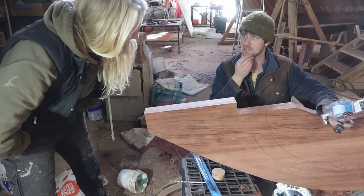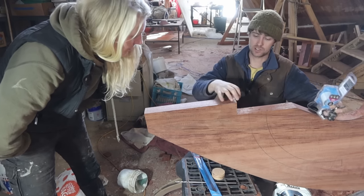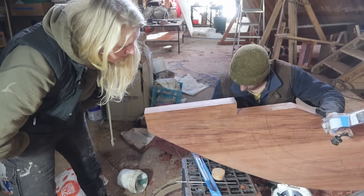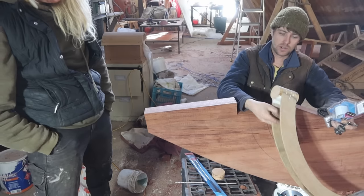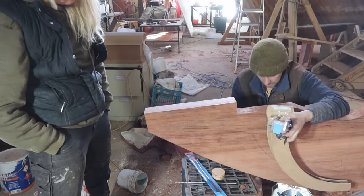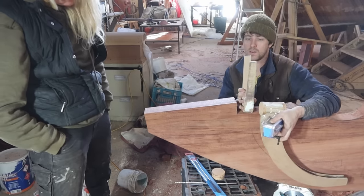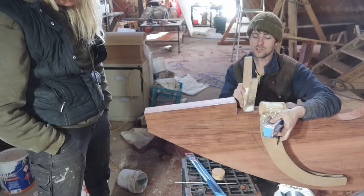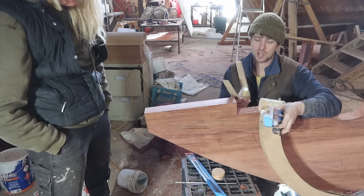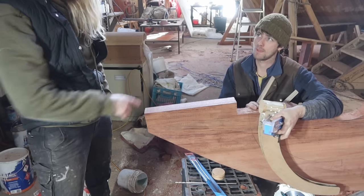I thought it was going to go through this. That's through the hole. Here it sits loosely and it pops out. And then when it pops out, it goes into a keyway on this bottom one that's mounted to there, and then this one on the hull. Oh, okay. So this is freely moving and that's mounted to the shaft. So when you turn the shaft, that turns, and then the shaft is in this hole. And that gets connected,